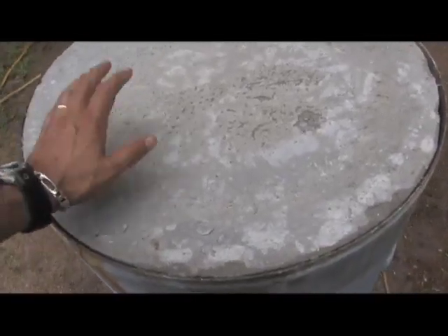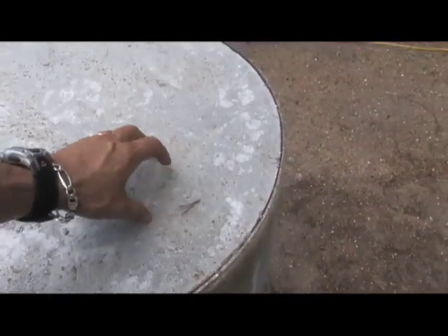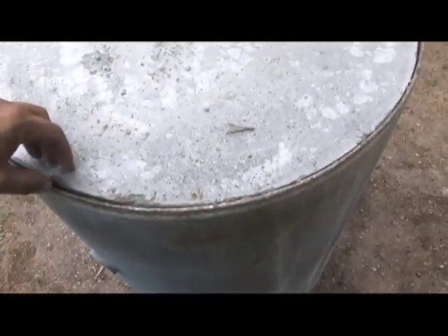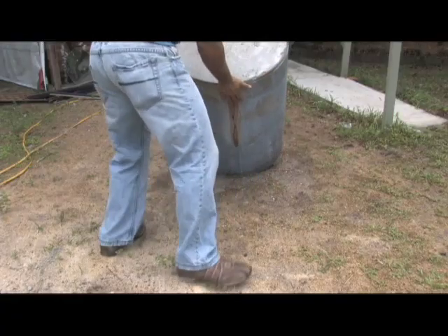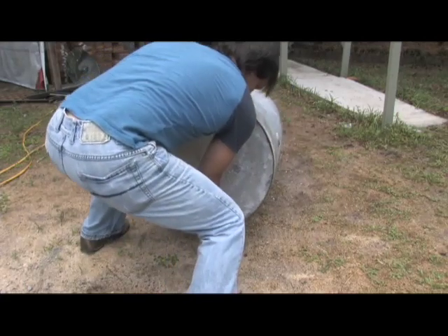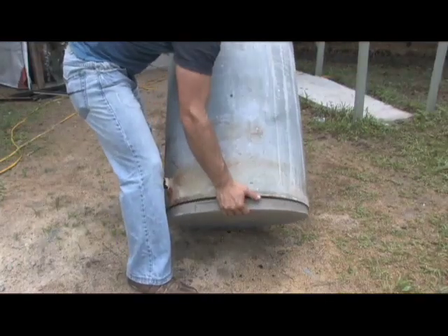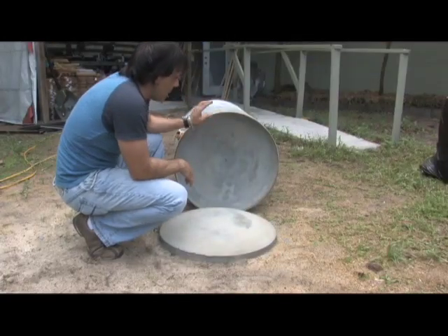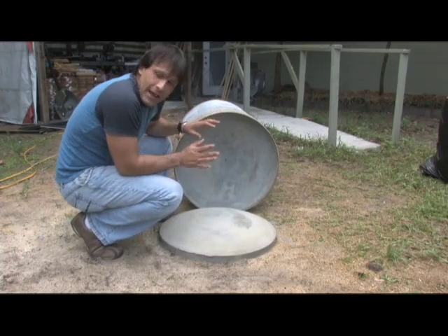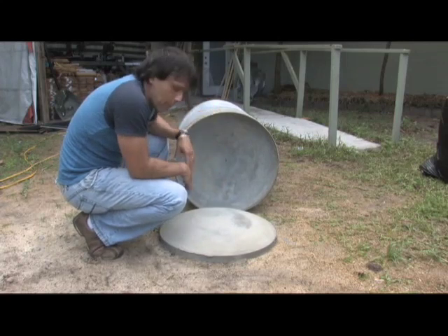You can see that the concrete's hardened — it's sat for about two days. One thing you want to be sure to do is pull these plastic spacers out. When this is kind of a firm mud, you don't want to try to pull them out when it's completely hard like this or you're going to have a heck of a time with it. You should wait 48 hours before you pop this out of there. The rim spacers you should pull out after about 24 hours, when it's like that soft but firm mud.